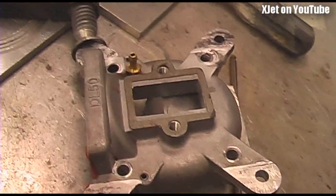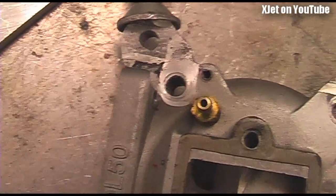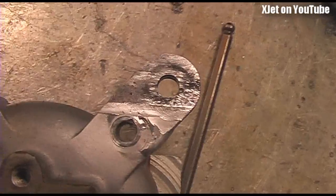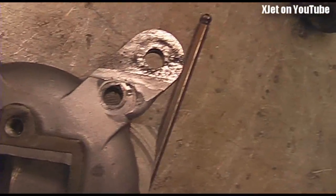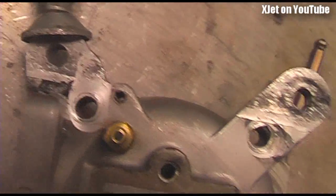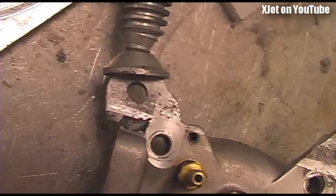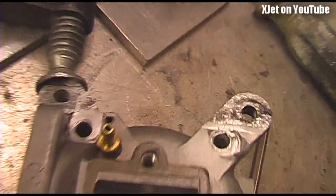Here's what I'm going to be welding up today - this is the back plate off my DL50 motor, the old DL50, and as you can see it's broken. I've already welded up the lugs and milled them down again so they fit, but this one broke again because this cast metal is actually quite hard to weld - it's quite often got impurities and inclusions in it. So I'm going to weld that up, and that will require AC welding.